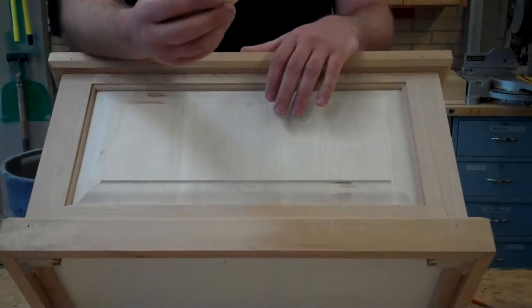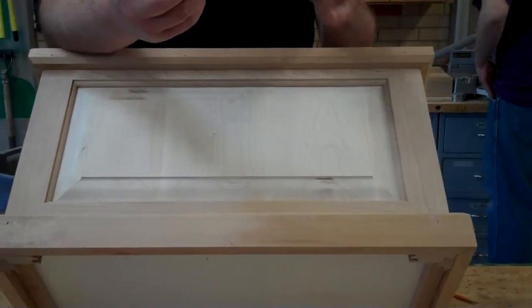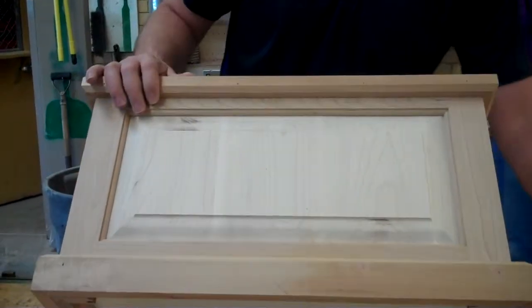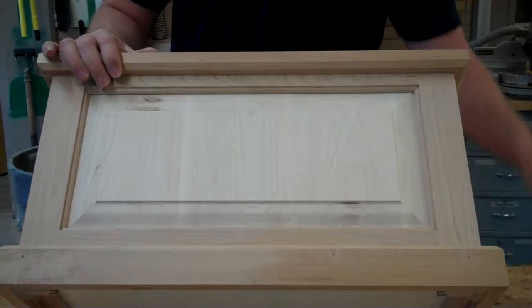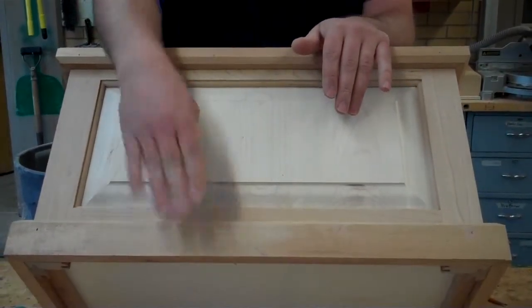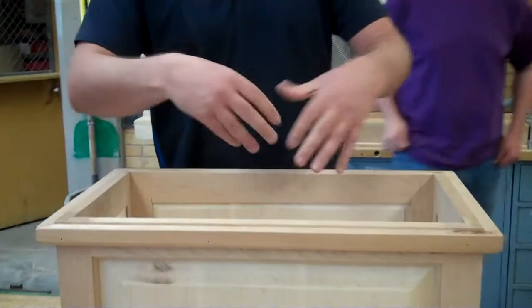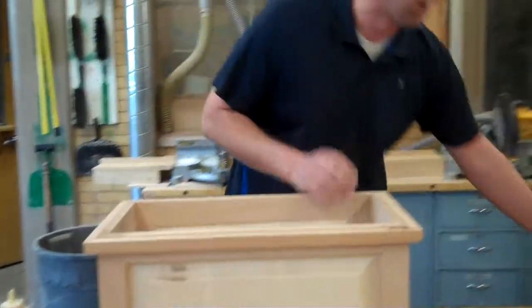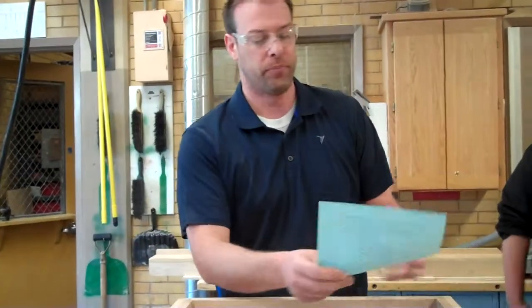You can't do the glue on huge holes. If you have a big crack, don't use the sawdust and glue. Use the wood filler on the big stuff. So if you have just a small little crack somewhere or a small little hole, that sawdust and glue works really well. All right, you'll do that on the whole outside of your storage chest, anywhere where there's holes, gaps, cracks, things like that. Sand it up really, really well.